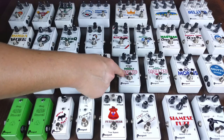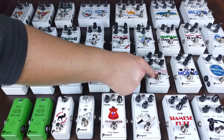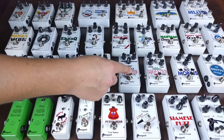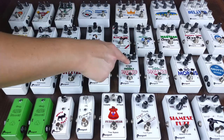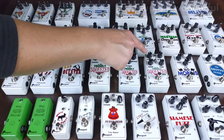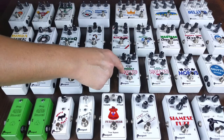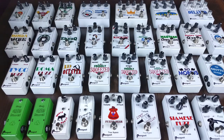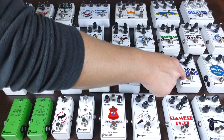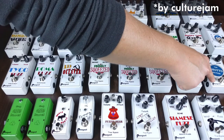A further advancement is the Freshly Squeezed Pro. This actually started as a build of the Keeley four knob compressor — the initial green box four knob compressor — but quickly turned into something I personalized. We have the blend knob, which is really the same as the attack knob, a tone control using the Simply Wonderful Tone circuit, and a toggle switch to adjust the input cut. I can now switch between two input cuts. Next, my only delay pedal right now, the Slow Mobius — this is the MadBeans Cave Dweller. The Grotto Reverb is the Box of Hall and uses a reverb chip.